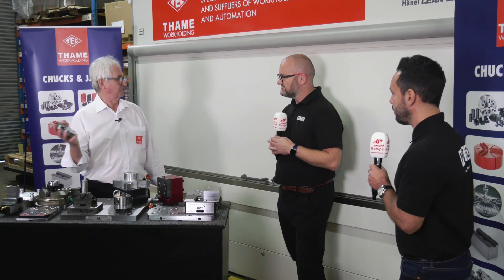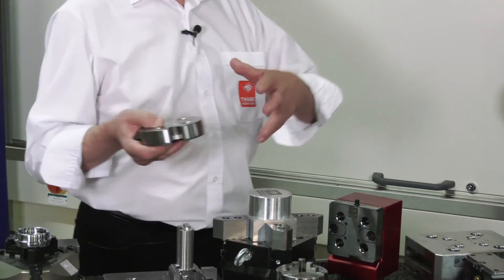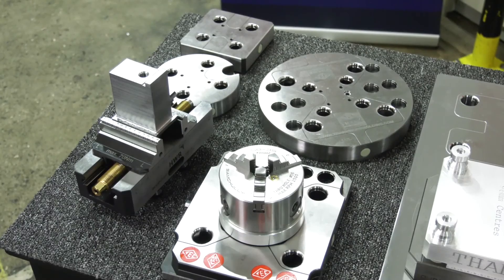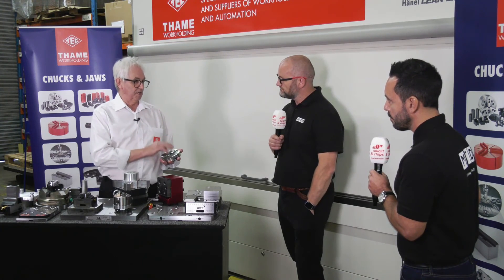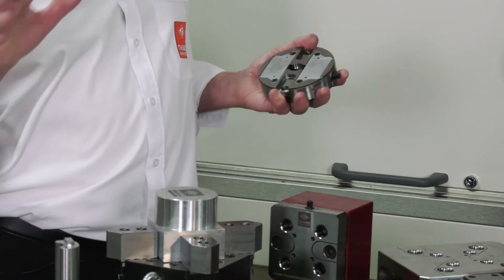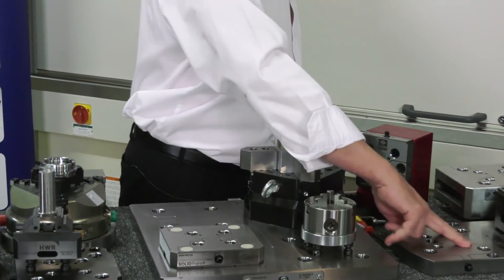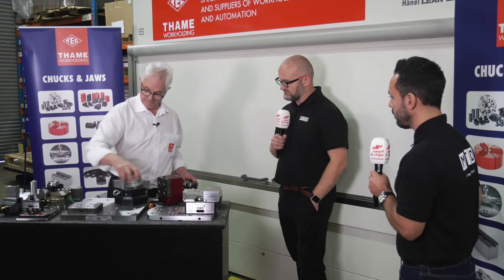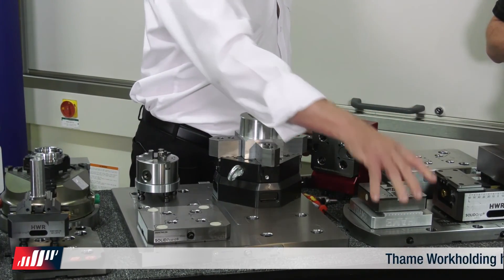Something like this is very, very cost effective - straight on the machine. You can go straight on the slots or you can drill the bed of your machine and position them all over. Now, there are lots of people that sell Zero Point - is there anything that makes this offering different from HWR? There are two things that are really key. One is the mechanism - it's a direct pull mechanism formed by wedges, and it has three to four times the power of existing systems. Secondly, we don't need an adaption plate because we have 52 and 96 in a single plate, so we can go from a very small component or vice to a larger one in the same plate.